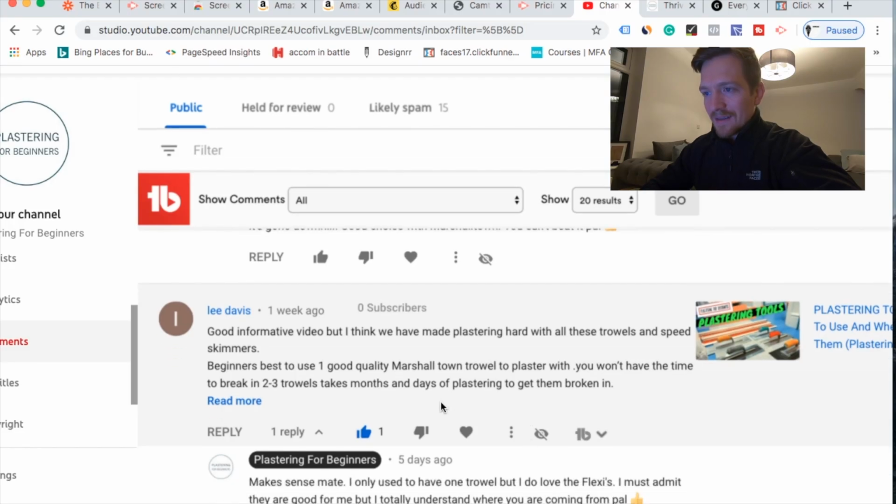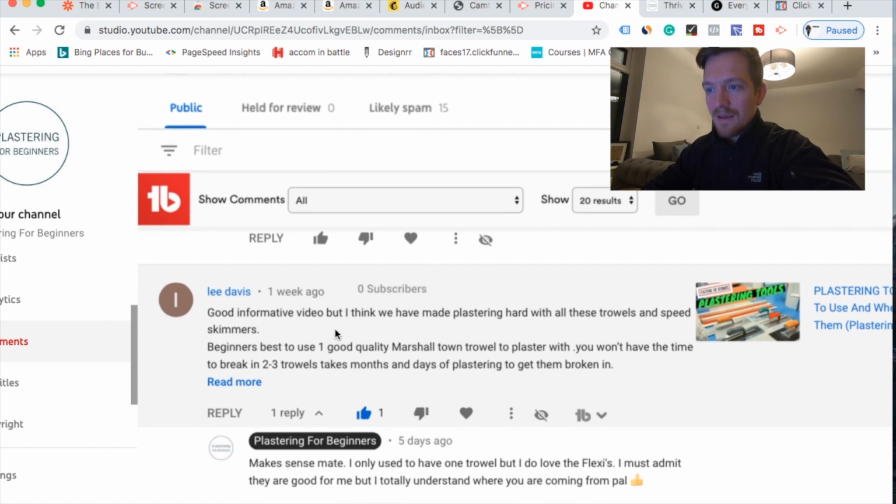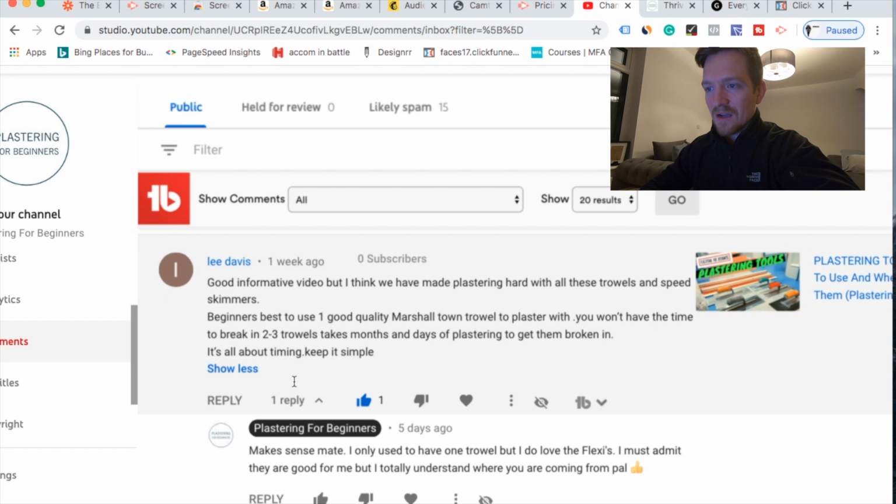What else have we got? Here we go. "Good informative video, but I think we have made plastering hard with all these trowels and speed skimmers." I think he means the speed skims. "Beginners are best to use one good quality Marshalltown trowel to plaster with. You won't have the time to break in two or three trowels. It takes months and days of plastering to get them broken in. It's all about timings, keeping it simple."